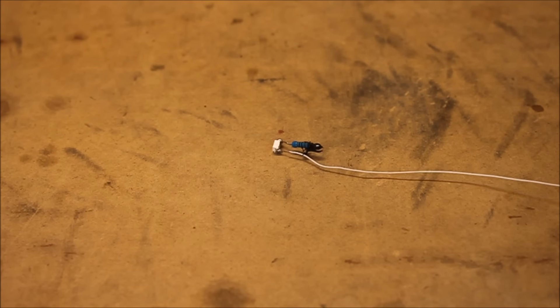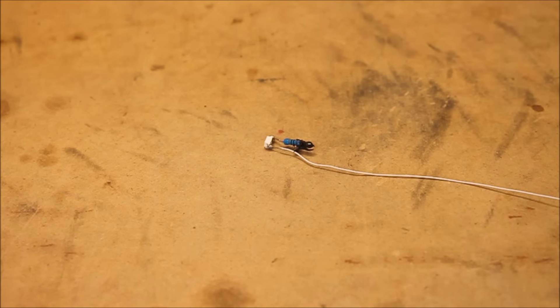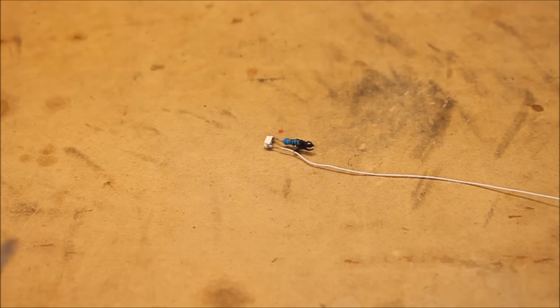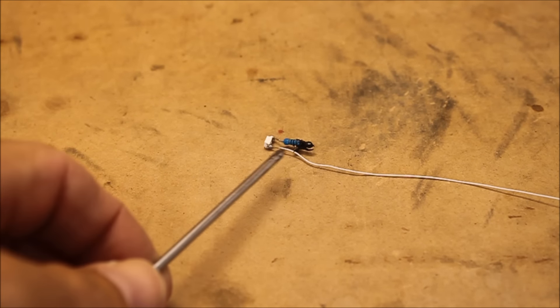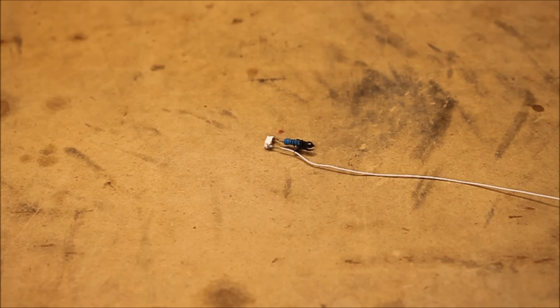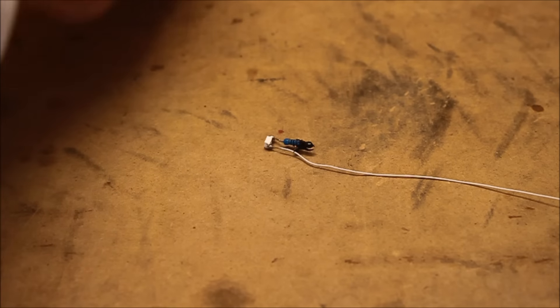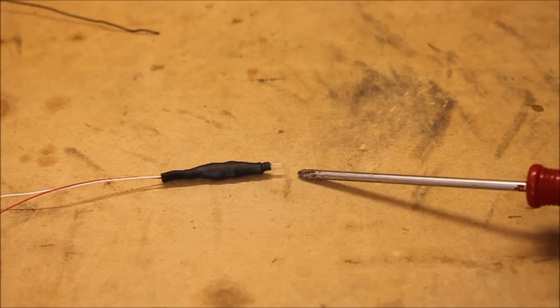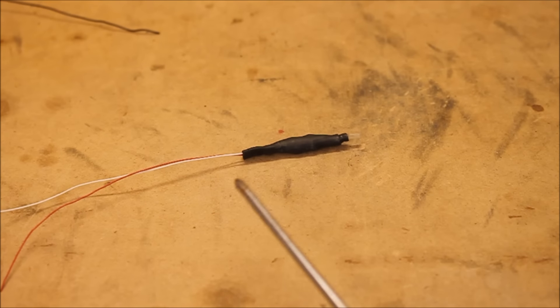What you end up with after you put it all together is an LED light with a resistor and standard magnet wire — I bought some red and some white. This is the finished product after you solder everything up. It takes some practice; very few of us are going to do it on the first try. I practiced for a couple of hours one afternoon until I stopped ruining and melting things and got it to work. I'll put one of these LED lights together using some shrink wrap along with the fiber optic tube to get it to fit. Everything is in there — two wires, the resistor, and the LED under that shrink wrap.